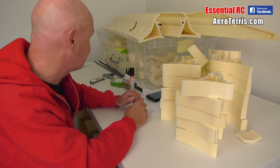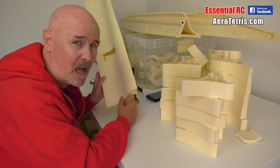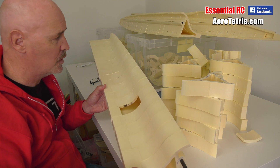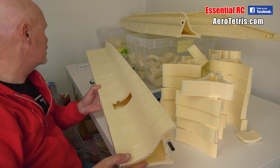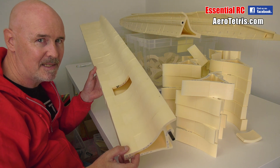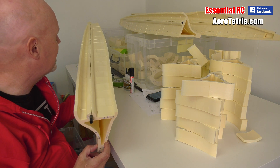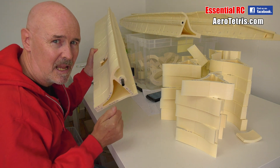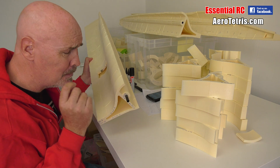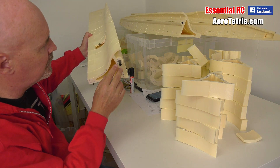So what have I done since the last video? I've started on the back section of the other side of the fuselage — it's virtually complete, which is good. That is sections 55 to 35, so about 20 sections, again on a 10mm carbon tube of 2mm thickness. So pretty rigid, but not rigid enough — not strong enough for flight, I don't think. Some other reinforcement needed.